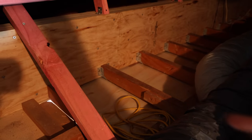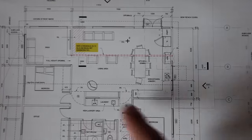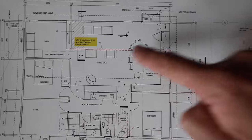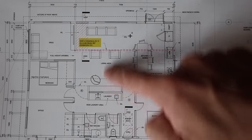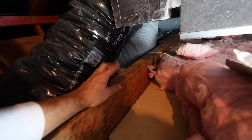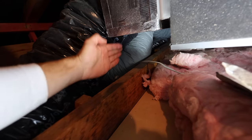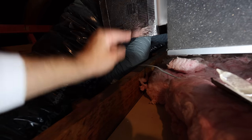There's a big beam that we put in and the ceiling runs in that direction, anchored off this big beam. It's probably better illustrated on the plans — the joists are running from this wall to the beam, but that span in the middle needs to be sorted out. Previously they've put a rough-sawn 6x2 called a strong back across the ceiling joists, resting one end on a wall and the other end on a wall. It's resting on the wall we need to take out, so we need to support the strong back.